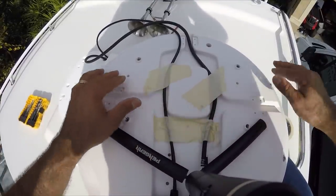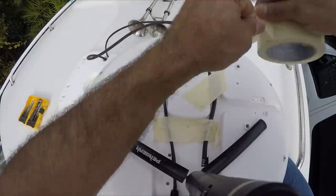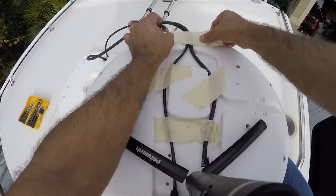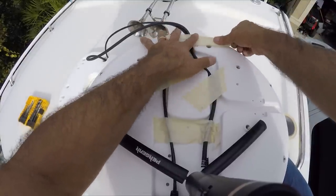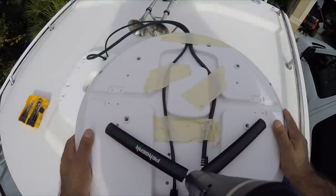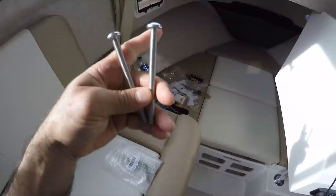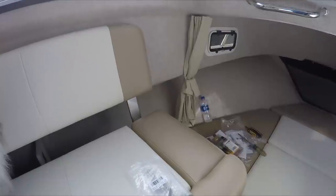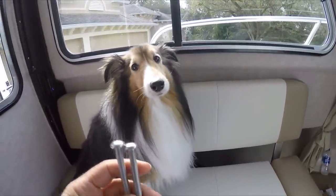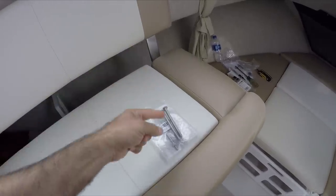The tape just protects the wires from getting pinched — that's the important thing. It came with a little bracket that I'm not going to use since the wires are going down. I'll put this piece of tape temporarily and rip it up later. All the wires are protected, so I can install the dome. This is the hardest part of the installation — you need two people, one inside the cabinet and another upstairs guiding the bolts. But since I have no help, I'll find another method.